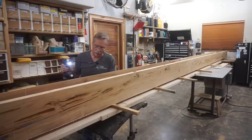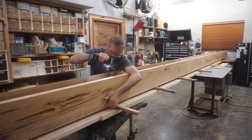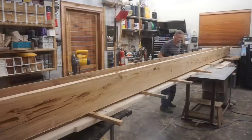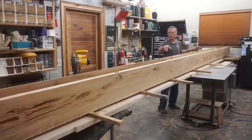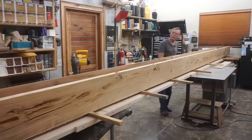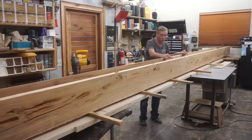Having a little bit of trouble right here getting the bottom of the beam to center up. It's barely a 16th of an inch different, but it's a case where I'm aiming for perfection and I'll settle for the best I can do. Well, I'm pleased with that. I've got the guide screws in all the way along. Very straight, everything's nice. I don't think that bottom centering issue will be a deal down there. So I'm just going to go back and fill in all these screws and get that bottom all drawn up tight. And then maybe then breathe a sigh of relief.